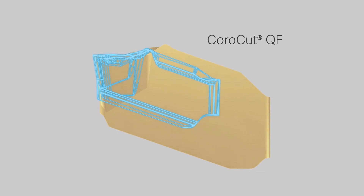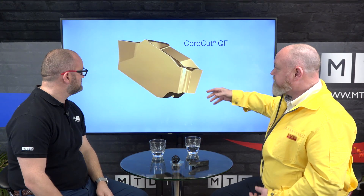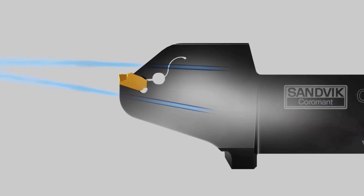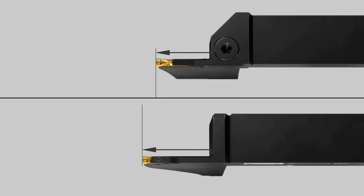When you add that in with the twin rail design carried across from QD, we also have an extra rail on the back of the insert. As you can see from behind, we've taken the QD concept, made a smaller insert to give extra clearance, and created a triple twin rail design. This gives a very stable insert interface with the tool. We also have a cam system — 90 degrees to clamp and unclamp — so it's very easy with no screw in that area to complicate the clamping design.